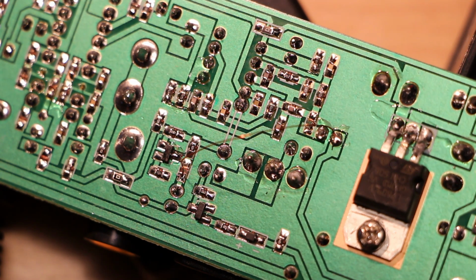The noise I'm hearing in my headphones sounds less like electronic hum and more like stuff that could actually be happening, so I'm going to try muting my microphone. Yeah, that's much better. The environmental noise is now really easy to hear, and the electronic hum is gone. Well, that might just be a simple fix. I will clean this up slightly, and then it's possible that just bypassing all of this, whatever they were trying to do, is a much better option. It's possible that this is going to be less good at driving cables, but I plan on running this through maybe a foot of cable to my audio interface, so that's not really a big deal.